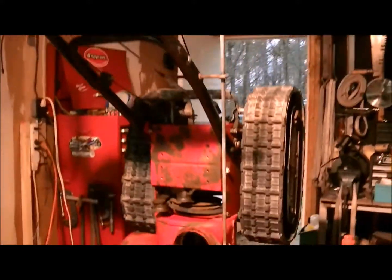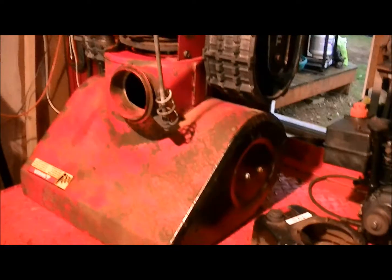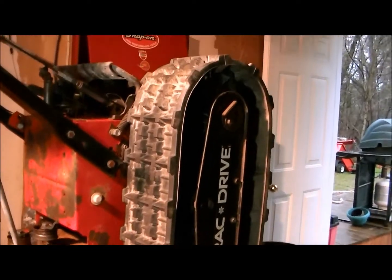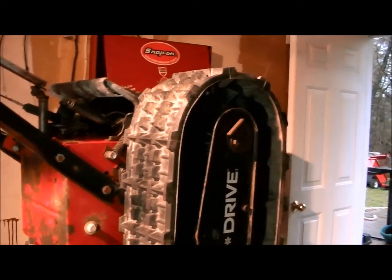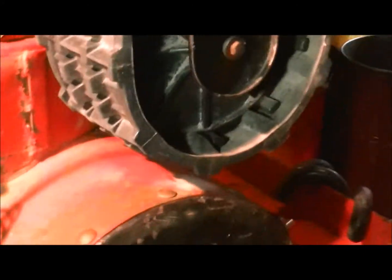Okay, so we've got this thing on its nose now. I'm gonna be pulling a few cables off it - those adjustable cables are handy for some of these snowblowers. If you ever had to adjust or remove one of these tracks, they're pretty straightforward: you take the outer plate off, there's a track adjustment - it's like an eccentric plate. I'll try to zoom in on it here. You just turn that to the right and it backs up against the plate on the bottom there, which tensions up the track. Pretty straightforward, but the tracks are all weather-cracked and on their way out.